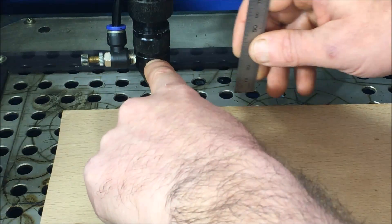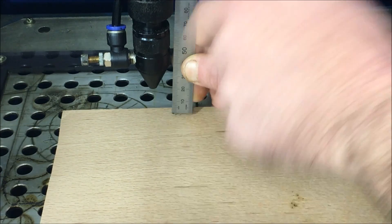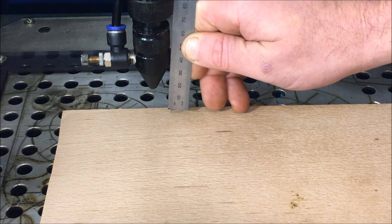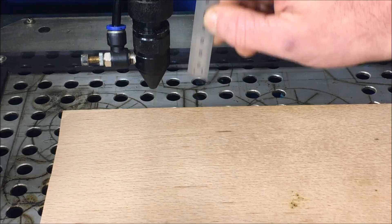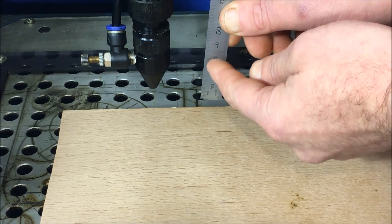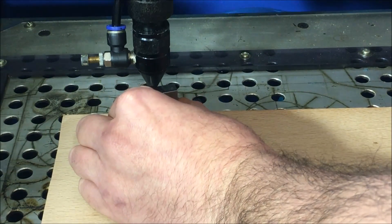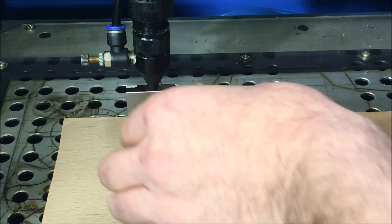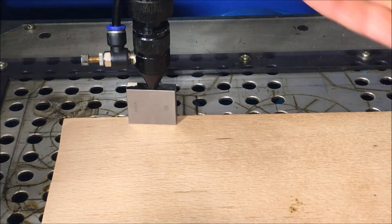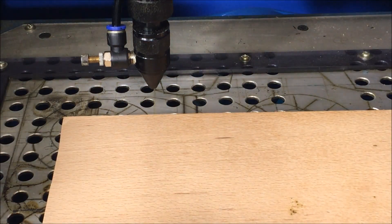The lens sits at about this position, and with a focal length of 50mm the focal point is around 20-something — maybe 21-22mm — below the bottom of the nozzle. Because I also want to take a series of measurements to look at what the beam profile is like, between say 30 and 15mm I'm going to make a measurement at every depth so I've got a series of lines to analyse. I'm going to set my depth accurately using a set of gauge blocks, but you can just as easily cut your own gauge blocks out of acrylic using your laser cutter first.